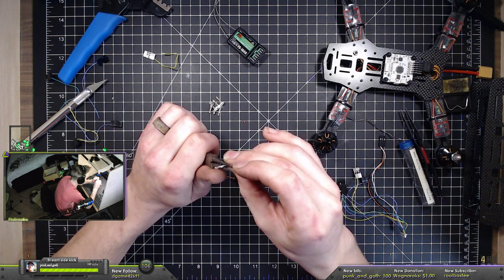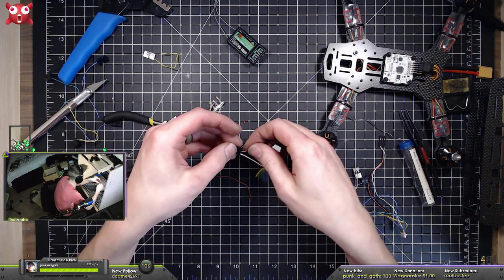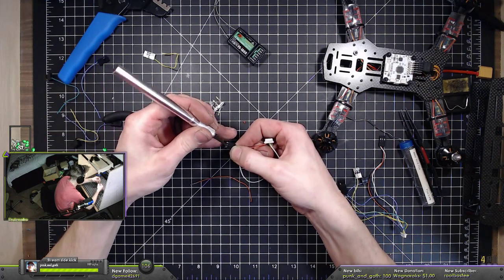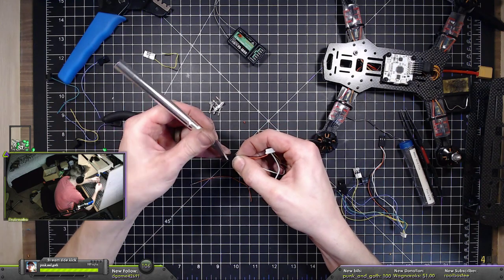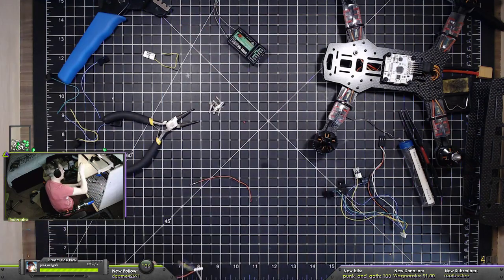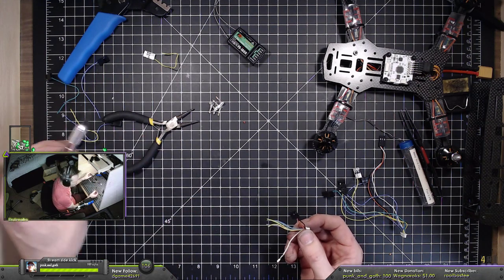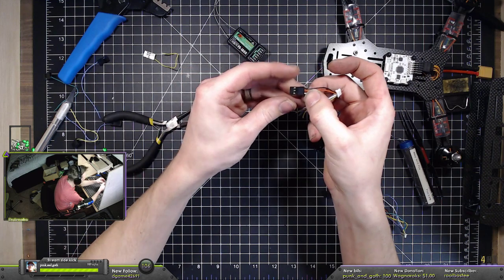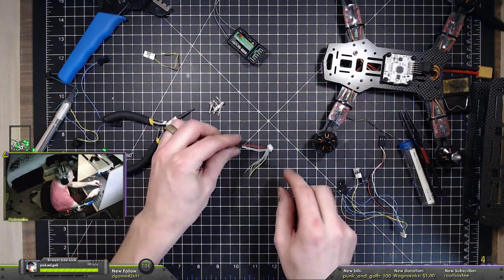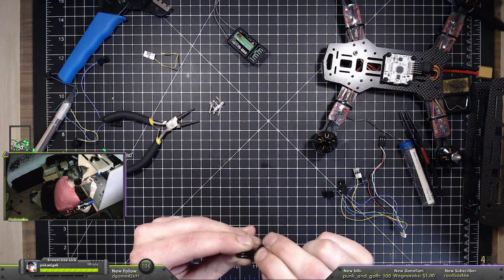Oh, let's go. Work with me here. There we go. Now we'll de-pin this white wire. So we'll lift up the little tab. Got caught again on the second notch. There we go. So now the red, white, and blue. Best colors. Dang, bro, stop making me look so easy. Well, I mean, it's kind of easy. Then we'll take this white one, and we'll slide it in here. There it is. So now, that's the first of... Oh, it didn't go all the way in. Second notch. Go, click it in. There it is.